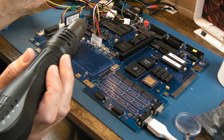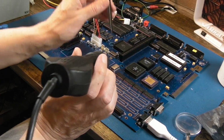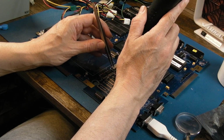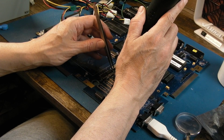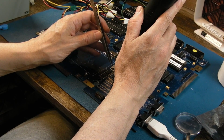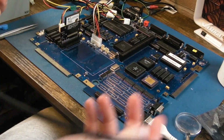And actually, the yellow doesn't look very yellow. It's a different kind of yellow. And I noticed that with the red. The red doesn't look how it should. So I actually think this has got some issue on the DAC side, in that the specification of HC chips for the DAC, I think, are wrong. I think there should be HCTs or LS, one of the two. I honestly can't remember what's on a 500 now. But in any case, I think the levels are wrong. So that's something I need to change. No problem. Anyway, I've moved that MELF.